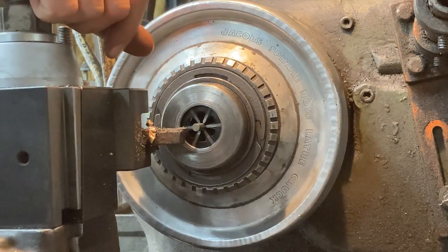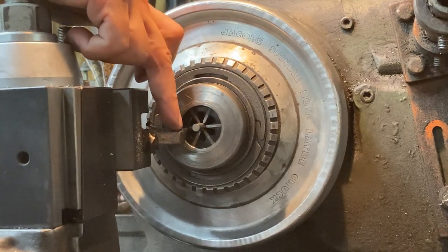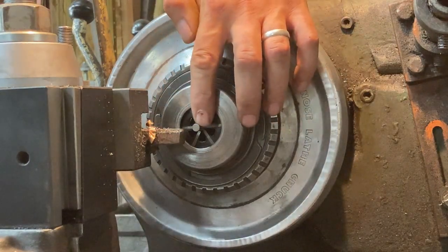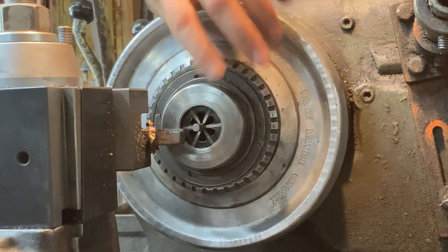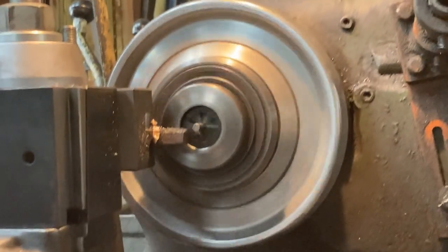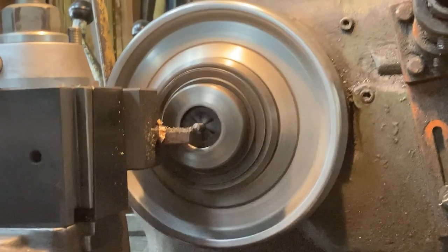We're going to be at 453 RPM with just a brazed carbide cutter - nothing fancy - just facing the end off flat so we can get a nice accurate shoulder on the nut and start a drilled hole accurately. Sorry guys, I just noticed that the vibration of this lathe while running will jiggle the camera around, so I'll be fixing that on the next video but please put up with it in the meantime.